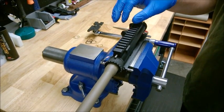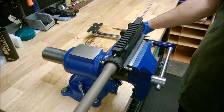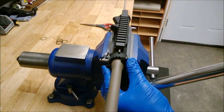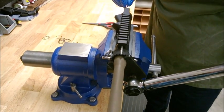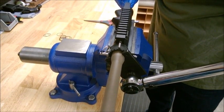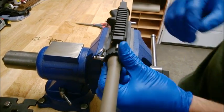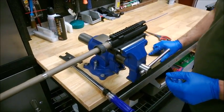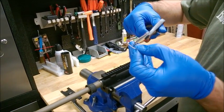We're going to explore the first scenario in which one shim is needed for correct alignment and torque of your barrel nut. We torque to 30 foot-pounds and see that we are just a little bit past alignment. To fix this problem, remove the barrel nut. Then select one barrel alignment shim and snip it in one position — it's quite thin, so it cuts very easily with simply a pair of scissors.